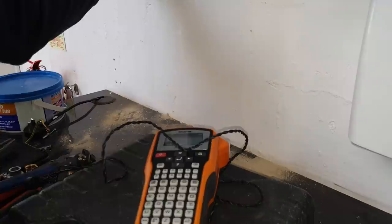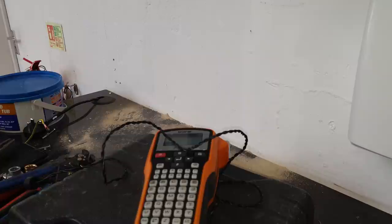And you noticed I cleaned all the dust out of the boxes. A lot of people, when I go around to jobs, there is so much rubble in some of these boxes. It's terrible, but I always clean them out. If I have an apprentice working with me, I always give them a brush. Say, brush out your boxes, make sure you don't leave any debris in there.